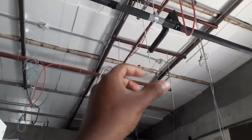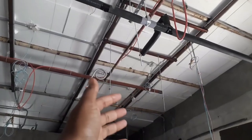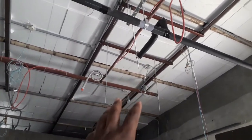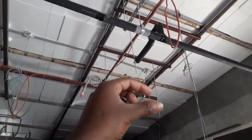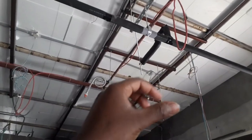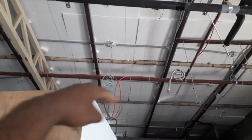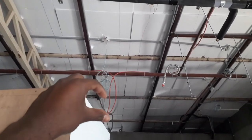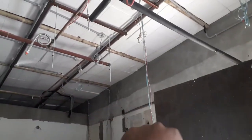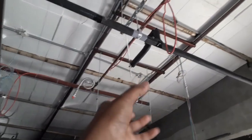Recently I was asked: if a drain pump is in the unit, can you leave the pipe as is? What is the design? If the drain pump is not provided in a ductable unit, you drain from the drain pipe directly. In ductable units, the whole ceiling is involved — the drain pipe needs to maintain slope, and the ceiling area is underneath. That's why the drain pump is included in the ductable unit — it handles the ceiling installation.